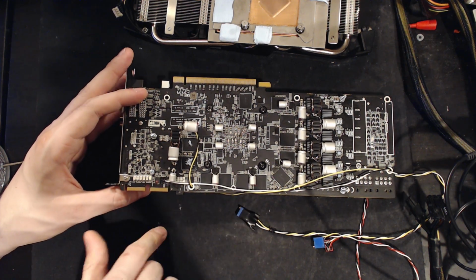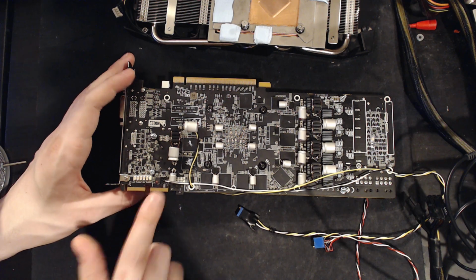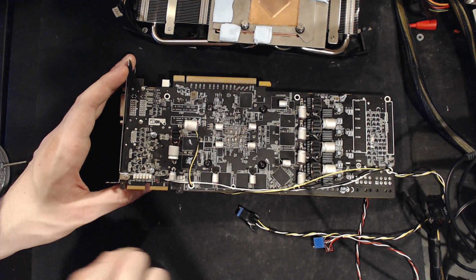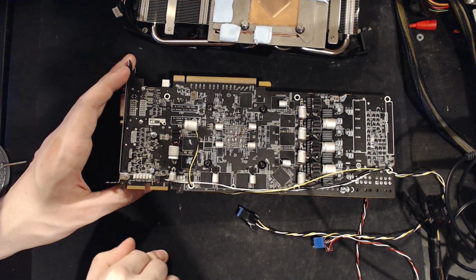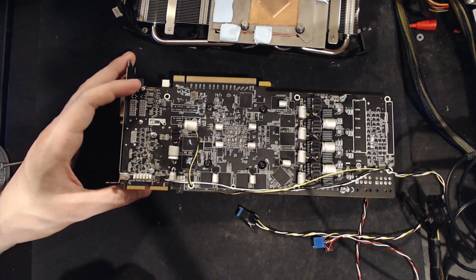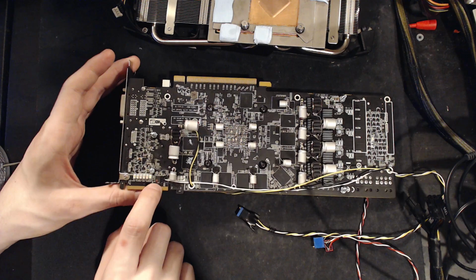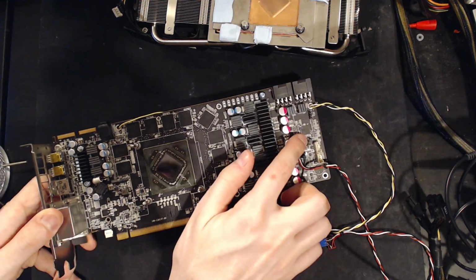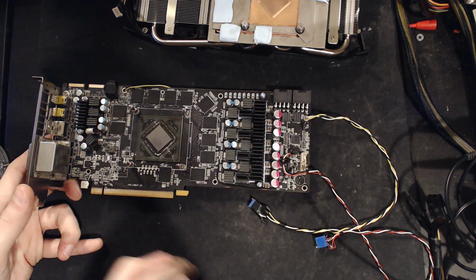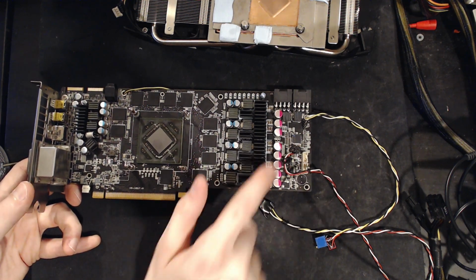Oh, yeah, that was the big selling point for this series of voltage controllers. These are completely reprogrammable. This is a 5-phase that can do 1+4, it can do 1+1, 1+2, 1+3, or 2+3. So you can run basically any voltage phase count configuration as long as it fits in 5. And the same goes for the CHL 8228. I think you could run anything from a 4+4 to a 1+7 setup off of one of these. These are pretty cool voltage controllers.